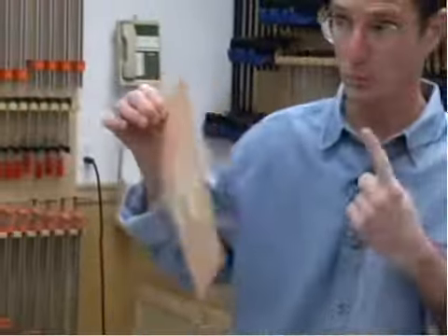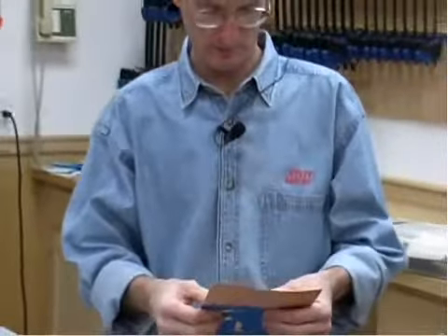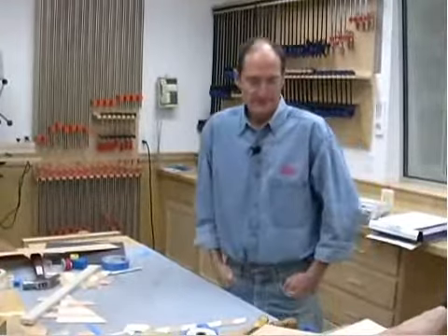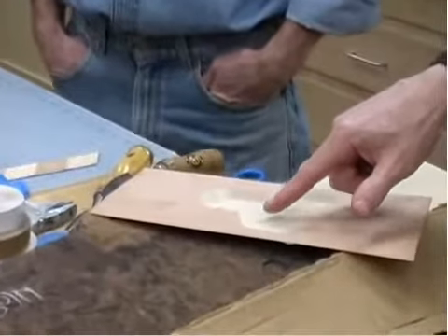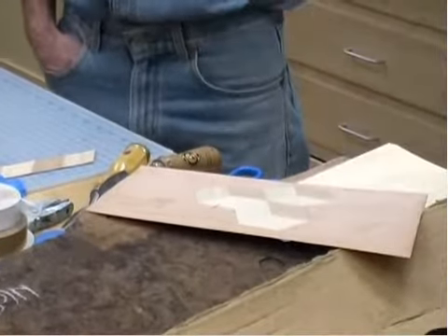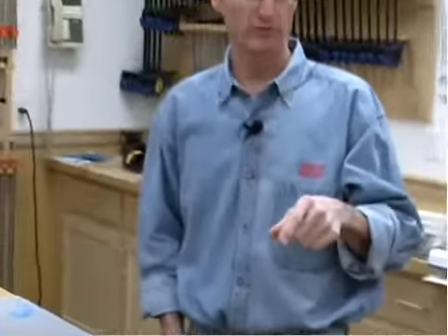Going back to something mentioned before — you could put that over a solid piece of cherry. This cherry veneer is going to move about the same as the solid cherry below it, but what about the other woods running at different grain directions? Are those little pieces going to make any difference? Probably not, and there are a couple of ways around that. First, if you use a resin glue, it's literally going to turn them both into the same thing — whatever the core does, it's going to take the top with it. Good kiln-dried lumber, not air-dried, makes a big difference. White yellow glue will hold up pretty well too. If this gets to be a whole lot bigger, then we're going to have some issues, but at this size we're probably going to be okay.